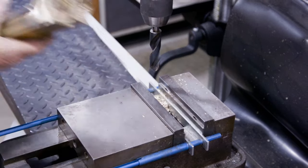You can just see it — it's just a struggle, a learning process. The legs look somewhat in order, but the problem I'm seeing here is a little flex. So I need to get a little strap around the outside. Over at the scrap bin I happened to have a piece of one inch by eighth inch flat bar stock, which was perfect. I'm marking them coming down four inches off the top and cutting some pieces to go all the way around to give it that support, because this thing is really heavy at this point and those legs would just push their way out.